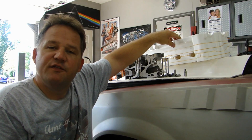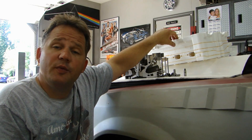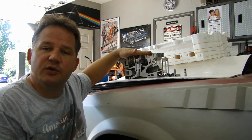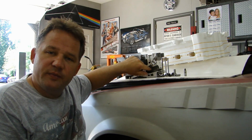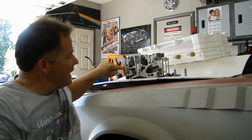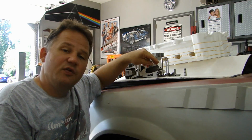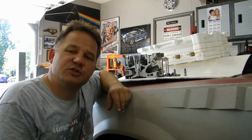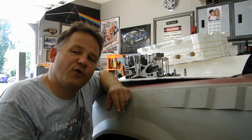So that's how cylinder heads are made and how they work. We talked about the foam model — the detailed foam model that goes through the Lost Foam process. The molten aluminum is poured in the mold, the foam disappears and we're left behind with the casting that gets machined with all of the features. We went over the intake where the injector sits, how the air and fuel mixes before it goes in the cylinder, how it comes out, the spark plug sitting in the middle, the difference between intake and exhaust valves, how the valves are put together with different components. I think that gives you a good idea of how cylinder heads work. If you have any questions give me a call or leave a comment — I answer all the comments and I'd be glad to get back to you. I hope you learned something.